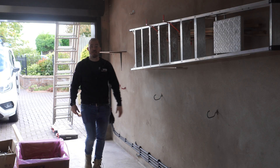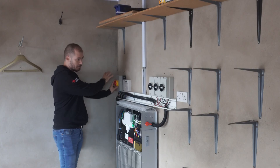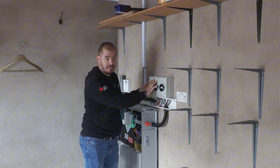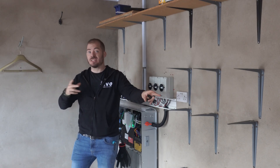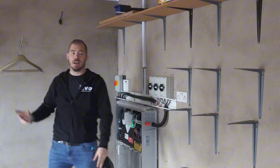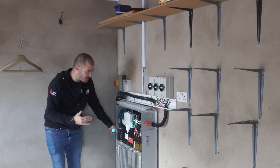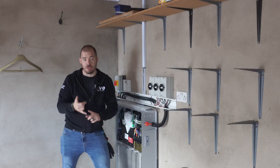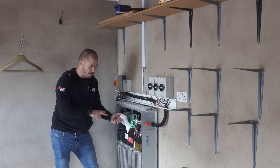This is the garage space we've got and over in this corner here we have the Tesla Powerwall 3. AC supply comes in, DC supplies, DC isolators on every string. We've also incorporated a MyEnergy Zappi — the customer wanted it in the garage so we've run that through and brought a Zappi to the corner. One of the things I really love about the Powerwall 3 is the fact that it is this monolithic design, so the inverter and the battery are all contained in one housing. We can see it's ready to commission. We're not quite finished on the roof with all the strings, but I will get this powered up to the customer and then we can start the handover process, get him on the app and go from there.